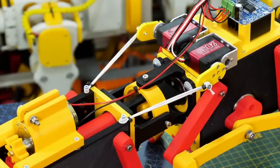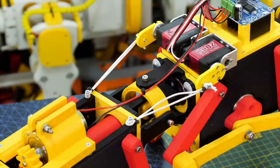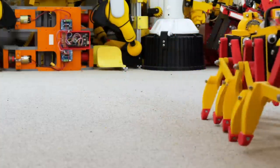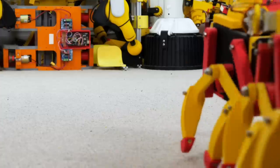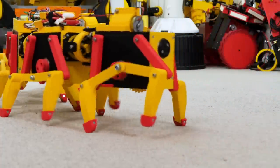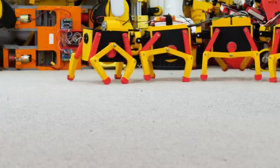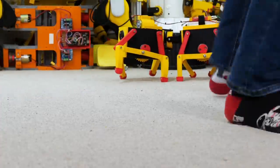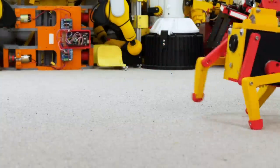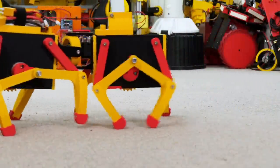For steering we're just going to pull these reins between the first and second segments — they're elastic so the legs don't get jammed together and it doesn't jam the mechanism. With that head unit held roughly in a straight line with the bungee cord it seems to walk in a straight line now rather than going in random directions, but I can steer if I want to. You can see me pulling the left servo to go left, then pulling the right servo to head round to the right. The turning circle isn't great but it's not too bad for something so long.